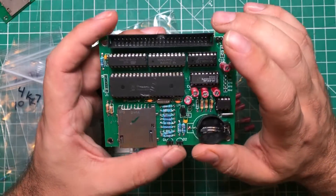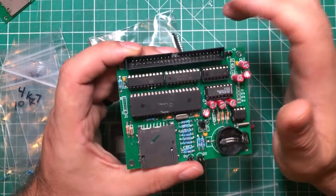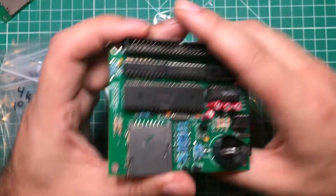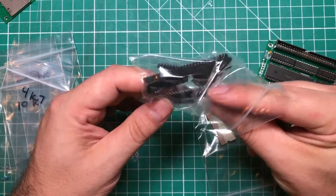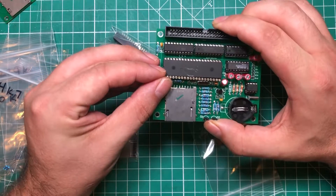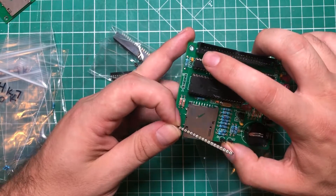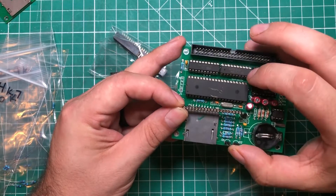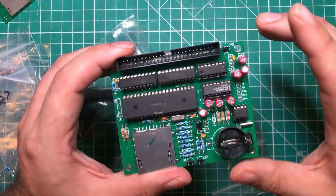For the most part there's nothing else that's very tricky — and the SD card isn't too bad either; if you get too much solder, just take it off. You've got a voltage regulator, some passive resistors, and a couple of chips. You don't have to socket them if you don't want to, but I did. A cool tip: if you take two 40-pin headers and break them appropriately, you can use two of those headers to socket four chips. That's why those chips sit a little taller — two headers do both sides and the two extra sockets, fitting absolutely perfectly.